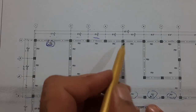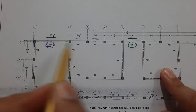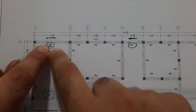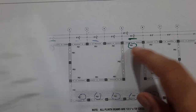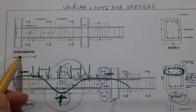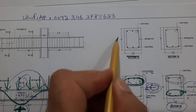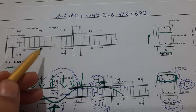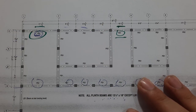If you are building more than two storeys, you should hire a structural engineer for design. This is plinth beam 1. Its spacing is less — about 10 feet 1.5 inches versus 17 feet 1.5 inches for beam 2, so the design differs. Plinth beam 1 has the same size: 13.5 inches by 18 inches, with three bars at the bottom and three at the top. We don't have extra steel rods in the upper or lower portions because the span is shorter.